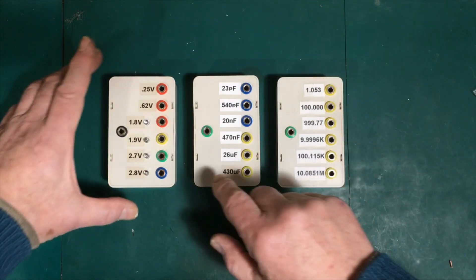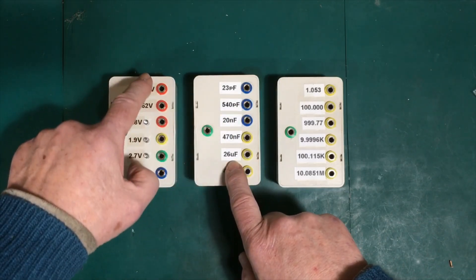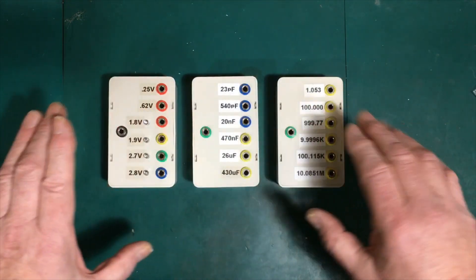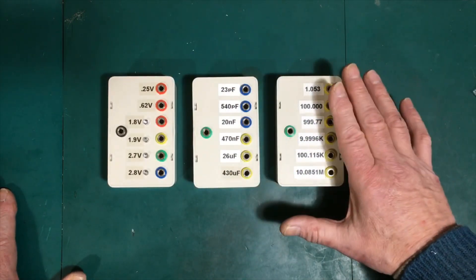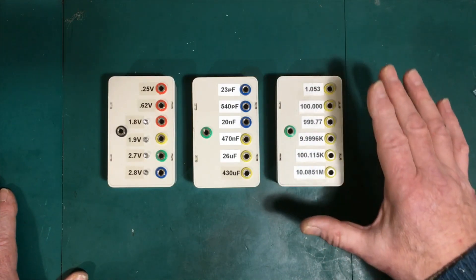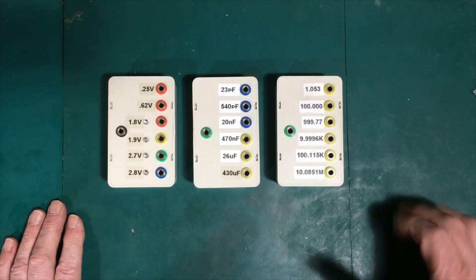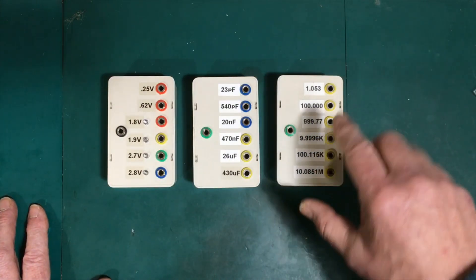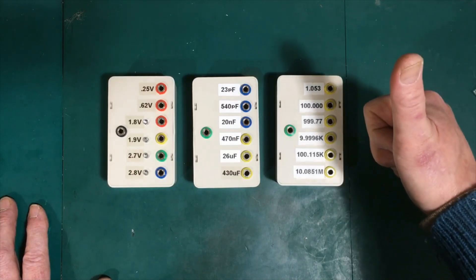There we are, all finished. I got labels on here — I ran out of white paper labels and had to use clear plastic labels, which unfortunately don't like to stick to plastic very much. I'm going to try a heat gun to get them to stick a little bit better. There we have it: resistance, capacitance, diodes — nice calibrated little boxes for rapidly checking whether a multimeter is close to specification. They won't be useful for a full calibration, but they're great for a quick and dirty checkout. I hope you enjoyed this video — we're going to use them to check out a meter I'm currently repairing. Click subscribe and the bell for notifications, and thank you very much for watching!